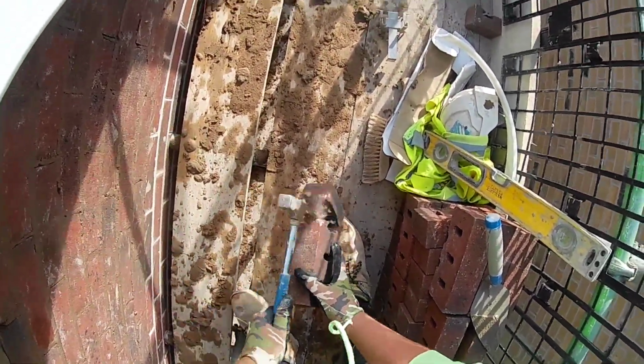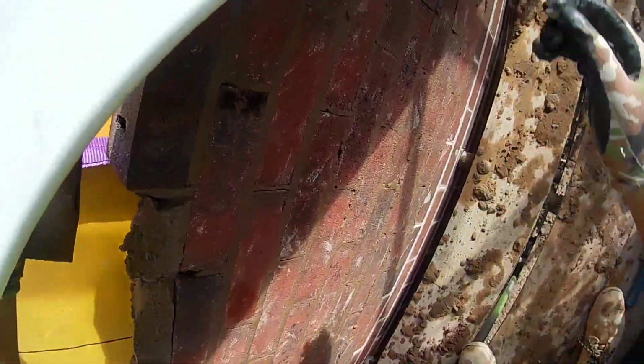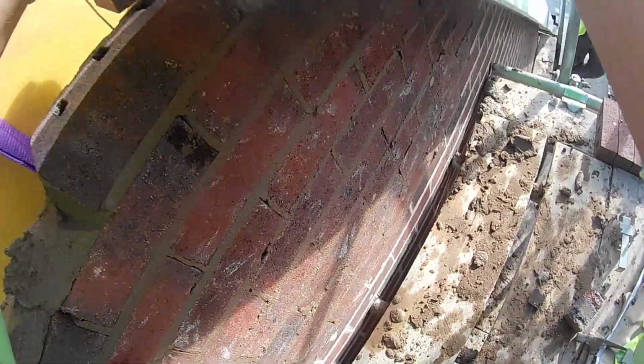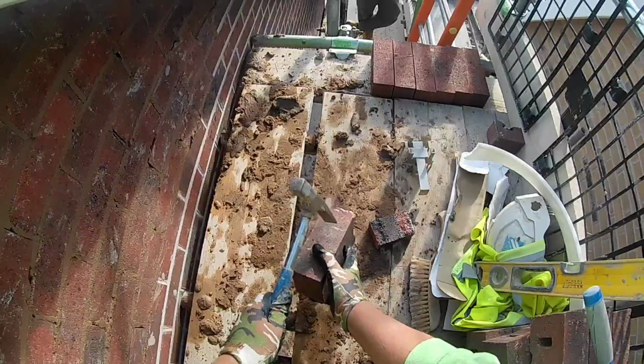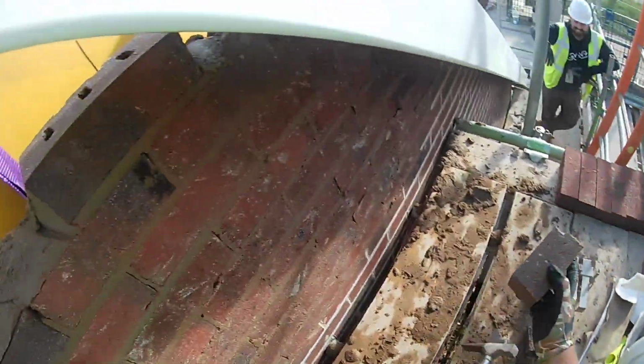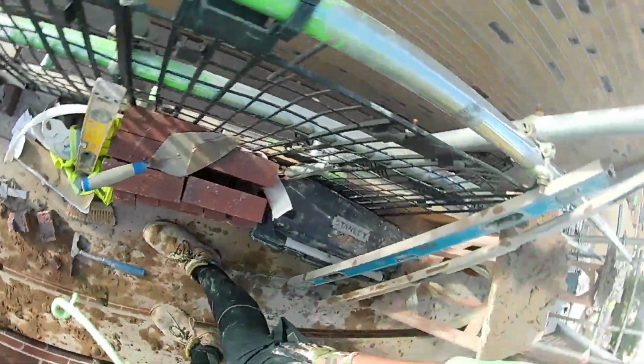So another thing, I think I touched on it in the last video, I've stopped trying to do the angle cuts around the gable ladder. I saw Kurt Malpass doing a video, he's not been doing many videos recently, but I saw a headcam where he was just cutting a little piece and straight jointing it up the face and soffit, and it looks just as good. You'll never see it right up the edge of that gable ladder, unless you're really looking.